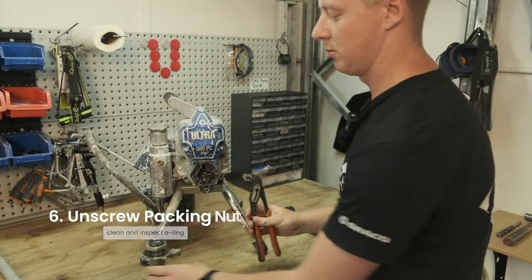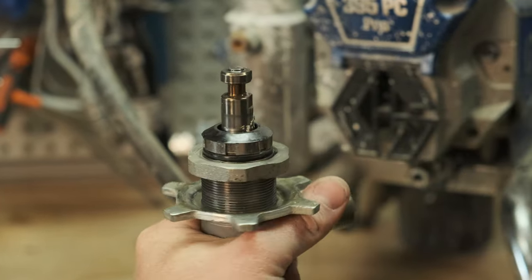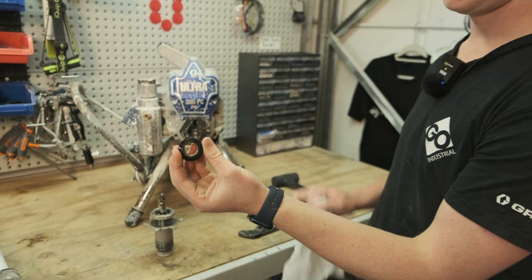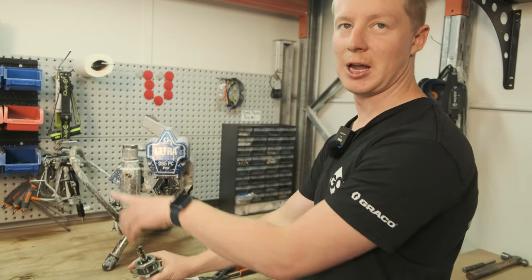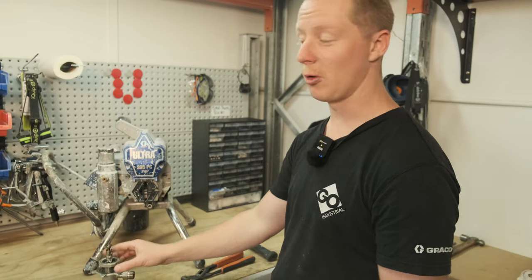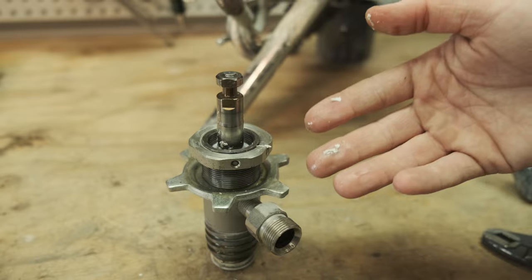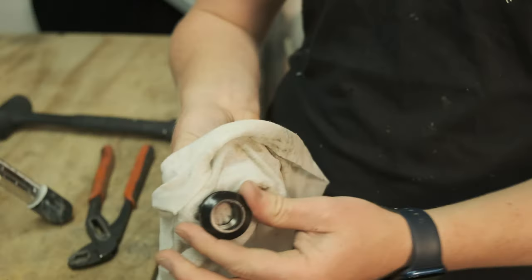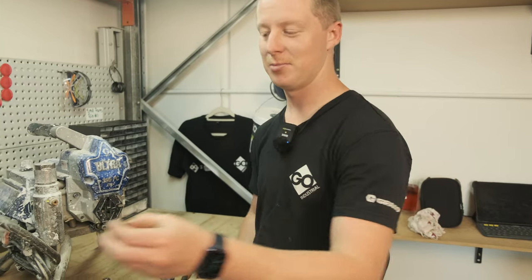For the next step you'll need a pair of multi-grips. You're going to take the locking ring off the top of the pump — once it's loose, spin it off with your hands. This is not only a locking nut, it's also an oil reservoir. That's where you put all of your throat seal liquid, or TSL. TSL is used to cool down the packings while the piston is stroking up and down, to prevent them from warping, which could cause pressure loss. Since I've got it apart, I'm just going to give it a bit of a clean — stick your finger in with a rag and clean out some of that dry paint. Once it's clean, put it aside — don't lose it.